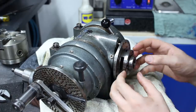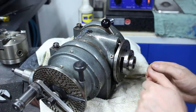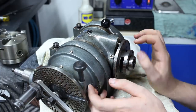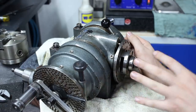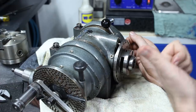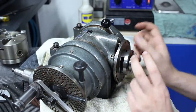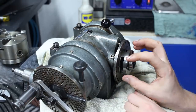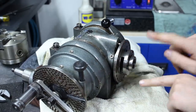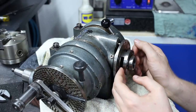I have an idea for that: I'm going to make an adapter plate that matches this taper and face contact, with the male taper of my lathe on the other end, so I can take my lathe chucks off the lathe and put them on here without having the part be re-dialed in. That allows me to use the 6-jaw chuck, my 5C collet chuck, soft-jaw chuck, and the magnetic chuck. I want to make it as low profile as possible because any additional overhang makes it less stiff.